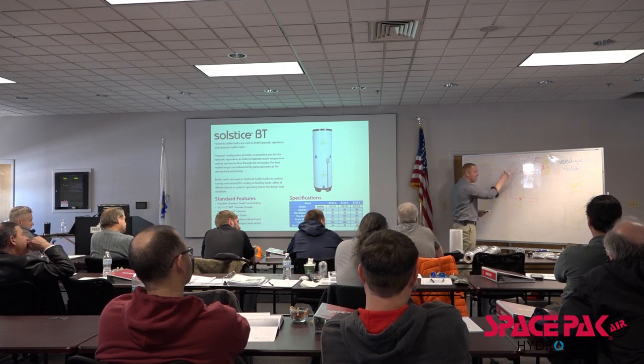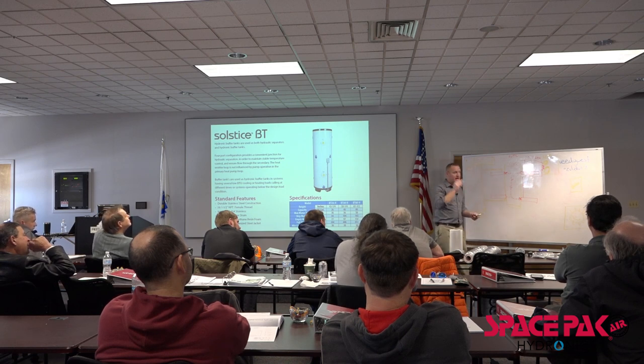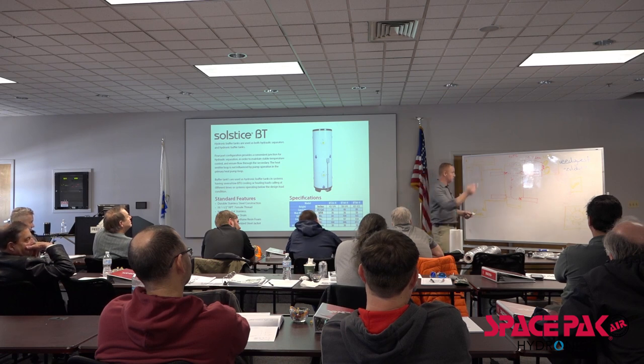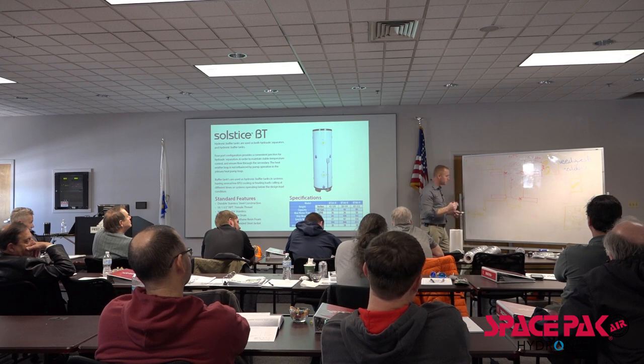If we didn't have something for hydraulic separation, anybody that's been in the industry long enough knows, if our manifold's not big enough and we've got 10 GPM and 1 GPM going, you will absolutely overpower that 1 GPM loop and not allow any water to go to it. Because it's going to be starving. You know, the big loop, the big motor is what will take over.